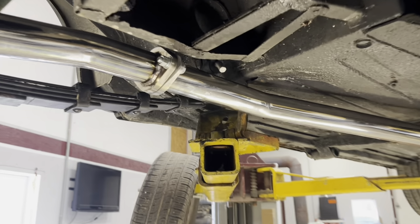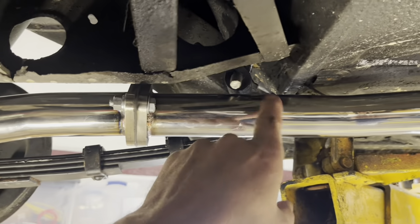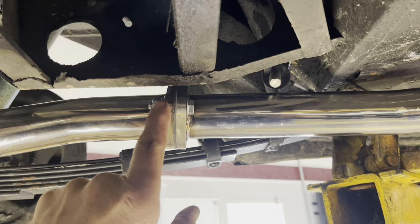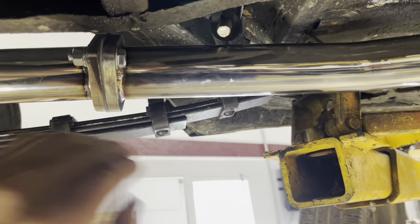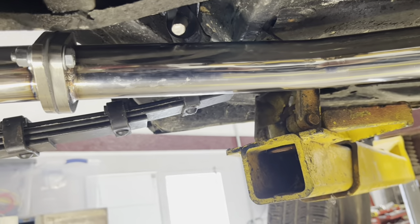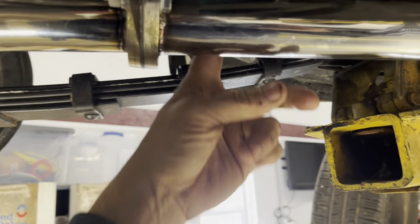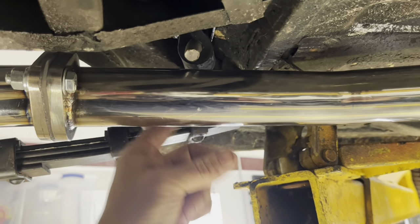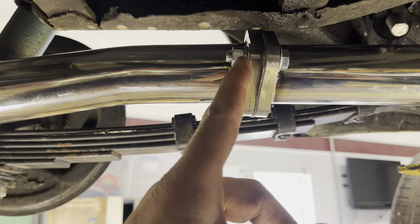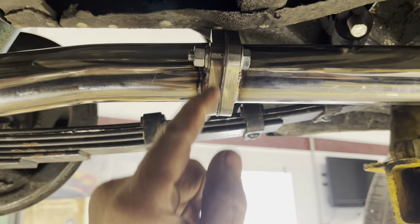In the case of this particular system, I was not at all happy with this joint. As you were tightening it down, it was pulling — it had a big gap on top again and wasn't quite closing up all the way. It was pulling this down and I'd like to keep it up higher, especially since he's not a small guy. With the weight, we don't want to drag this thing, but it was putting a lot of tension on the hanger. So I went ahead and actually cut it right through here, let that tip a little bit, and then rewelded it myself.